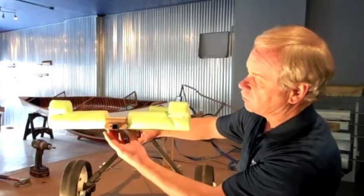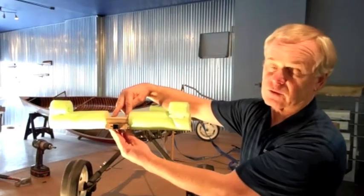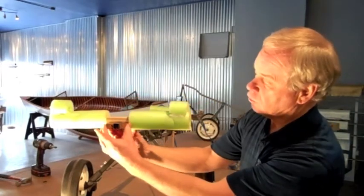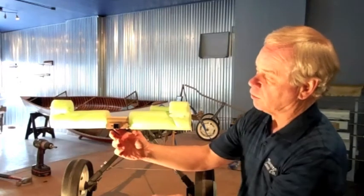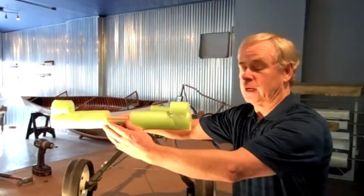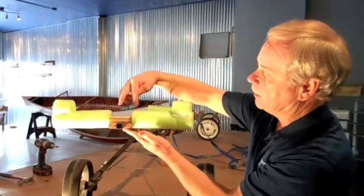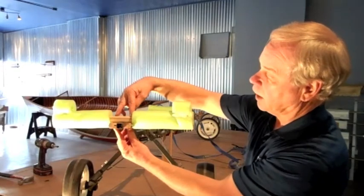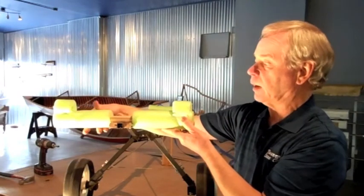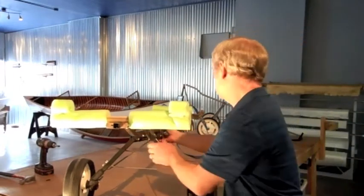We added two little blocks just to give a little bit more strength and more of a location in which to fasten our wood bar to. So we bolted these two pieces through, and that's a 3/4 inch by 1 1/4 inch piece. All the pieces we've used are hardwood versus pine. I just have a preference for the hardwoods. So we've got those two pieces bolted on. We then came underneath and screwed our 1 by into that, and that's holding on this bar with the noodles on. And that was the first modification that we made.